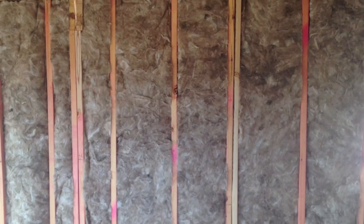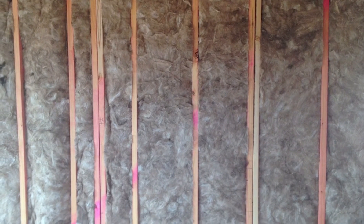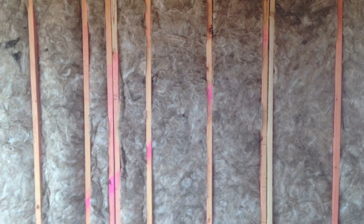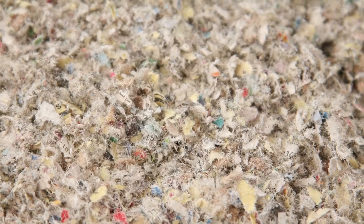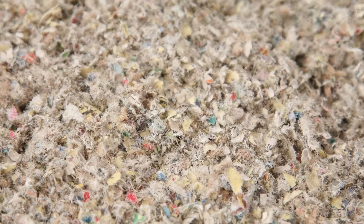There are several different options of insulation to use. Some builders will sell batt insulation; there's also a cellulose blown-in insulation for the walls, which is what this house will actually get. It's a mixture of ground-up insulation mixed with a liquid adhesive.